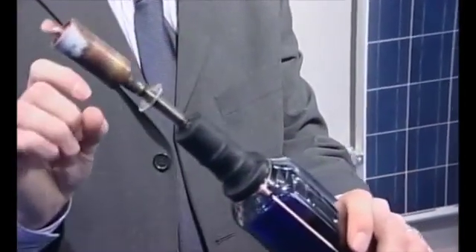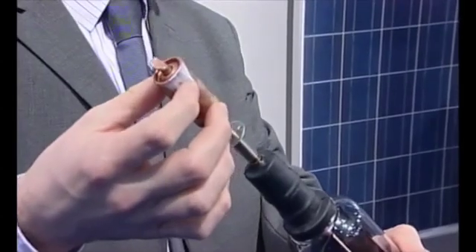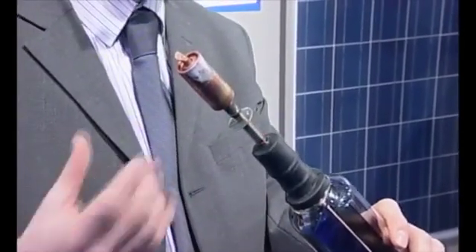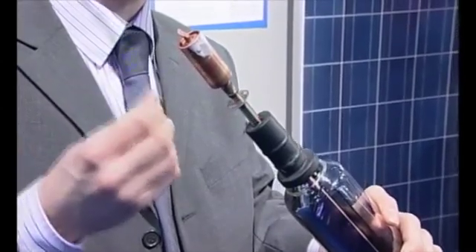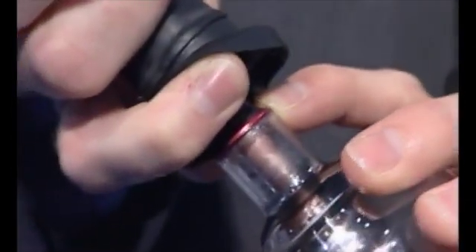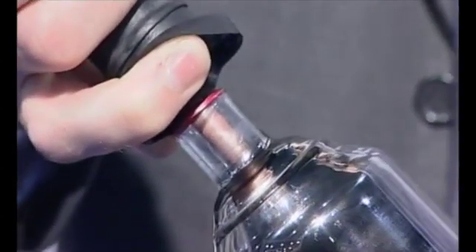The blue surface is the active surface of the unit. This end of the tube is completely closed and sealed, so the liquid does not flow through it. This enables installers to attach the tubes after a system is commissioned, and if they ever need to remove a tube, they don't need to drain the system. This contains a temperature limiter which protects the collector from achieving extremely high temperatures in stagnation conditions — one of the ways we protect the fluid and control pressure. And the hermetic metal-to-glass seal inside every evacuated tube we manufacture suspends the copper away from the glass, stopping expansion of the copper damaging the glass — which is one of the reasons we can offer the full 20-year warranty if it's installed correctly.